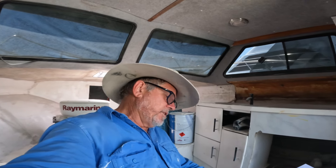I did have some problems where, essentially, when the sun went over it, it destroyed the resin — absolutely destroyed it, really made a mess. I don't have film of a lot of this, but what that meant is I had to grind it all back — lots and lots of grinding, hours and hours of grinding — just to cut it back and do it all again. That's one of the big things to be really mindful of: the sun, the heat. The MEKP mixture is going to go off very, very quickly and give you no time to work with it.